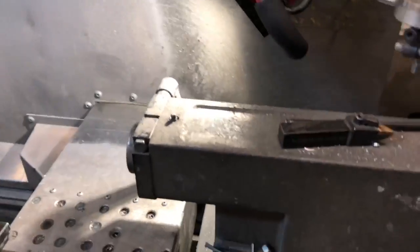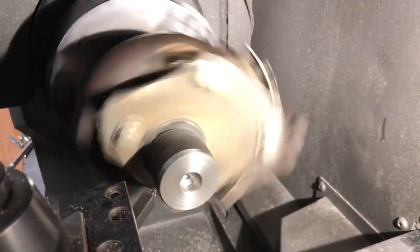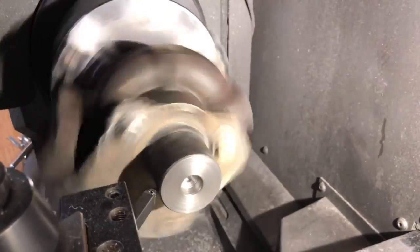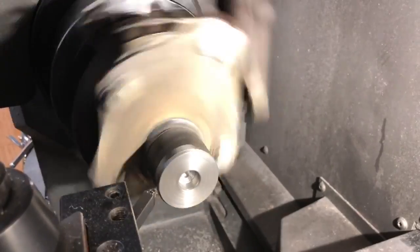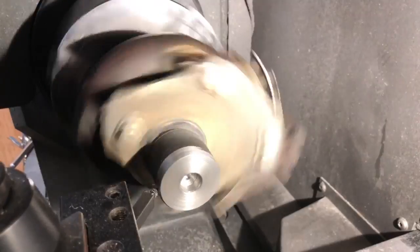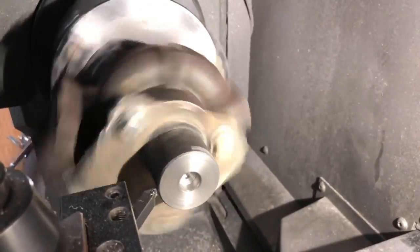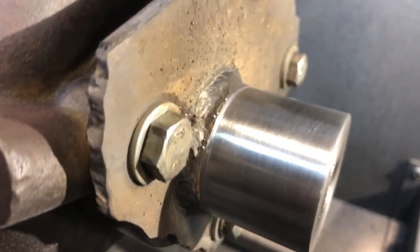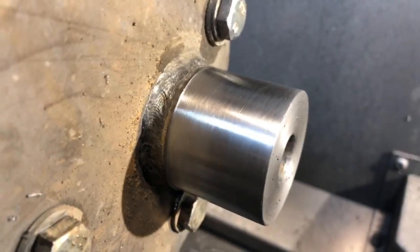Usually if it was off by 5, I would just surface it out, but since it was so far off, I had to go back and correct it before I could surface it out, because if I surfaced it out, it would move in the cartridge farther than I would like it to be if I was doing a surface job like that. If I surface it out 17 thousandths in depth, that makes the turbine wheel 17 thousandths deeper into the turbine housing, and that usually puts the turbine wheel inducer blade 17 thousandths more out of the flow stream and can hurt performance.